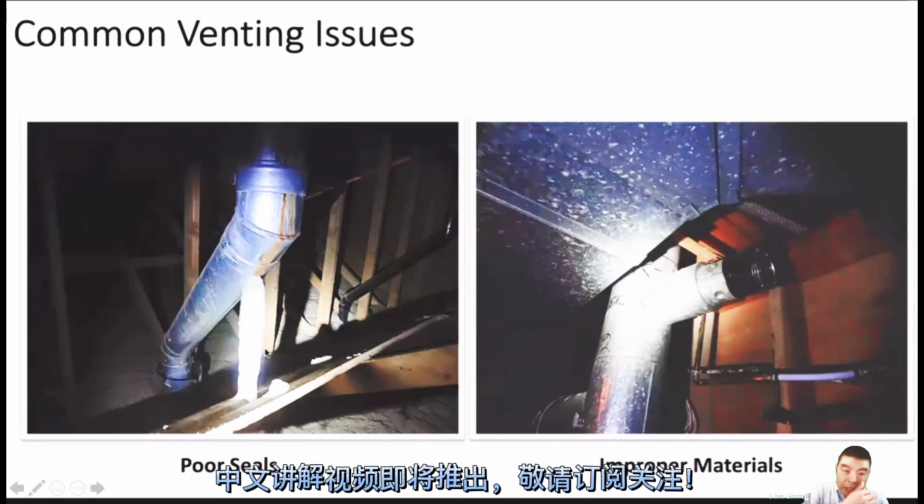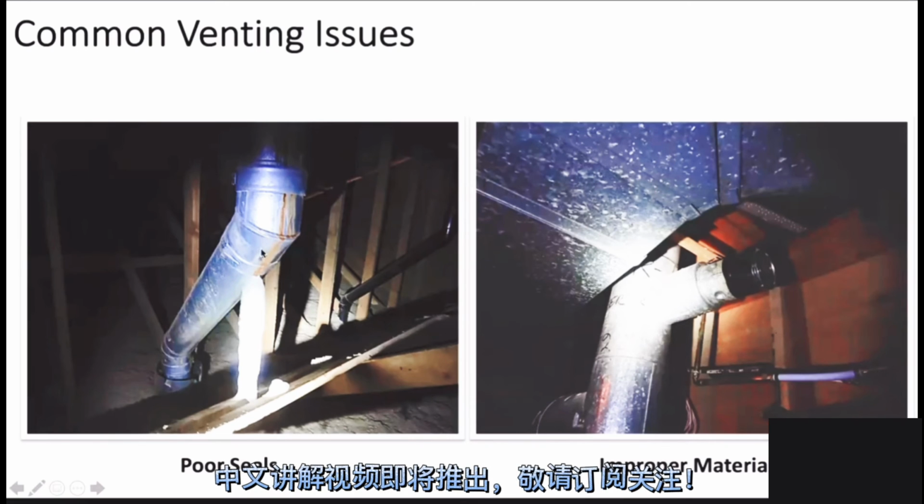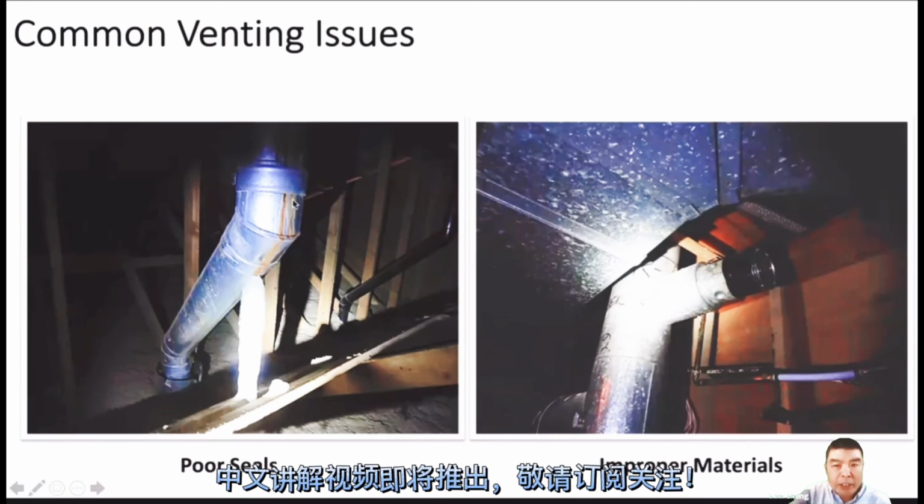Okay, this one is a leak around the B vent. Sometimes the B vent is just pushed together, it clicks in place or turns to tighten. But sometimes, after running a long time, or if the angle is changed, or some heavy stuff makes it not vertical and not horizontal, the seal gets bigger than before, and condensed water still comes out from there. So like this, we should note it to the owner, and maybe this elbow needs to be changed.